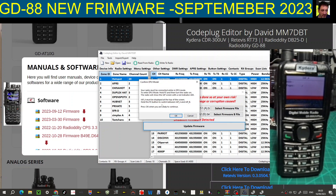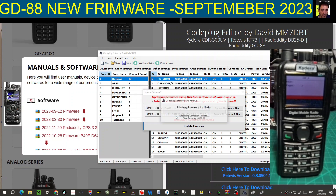Now it's asking you to select the firmware for the b.bin as well - hover and it will show you. Hit Update Firmware and click OK. Your radio must be connected while in DFU mode. To enter DFU mode, press and hold P2 then turn the radio on. The radio will show the IAP screen with a red indicator LED. IAP must be displayed at the top of the screen, then you hold the button to switch to IAPB. Press OK when you're ready.